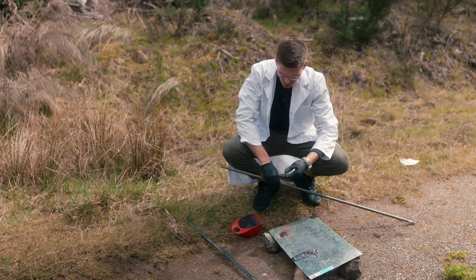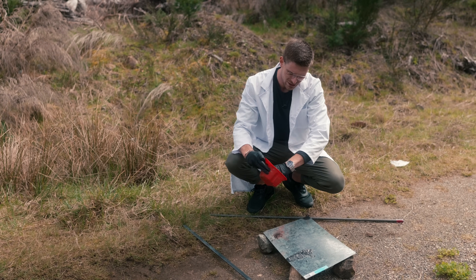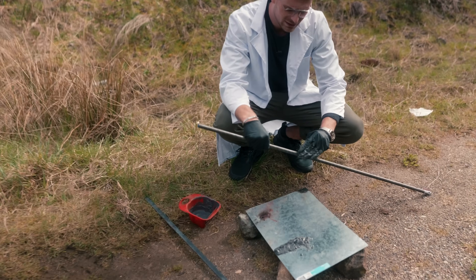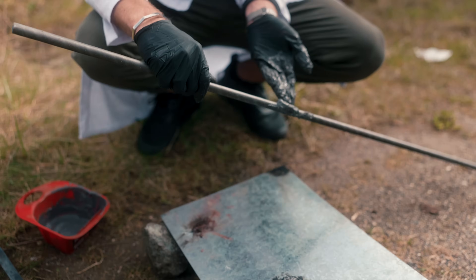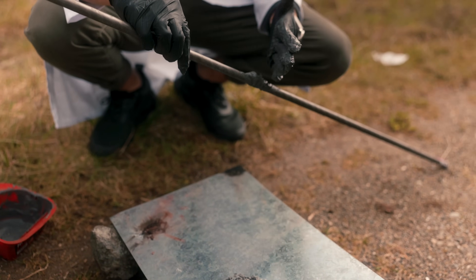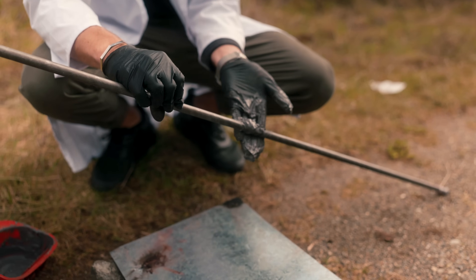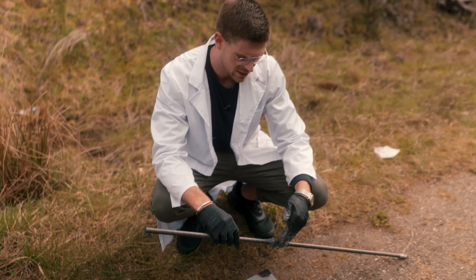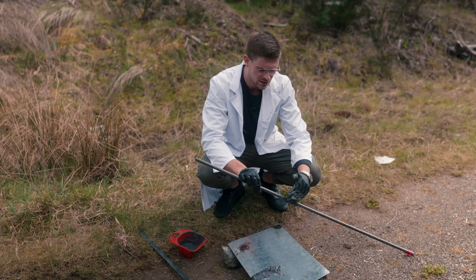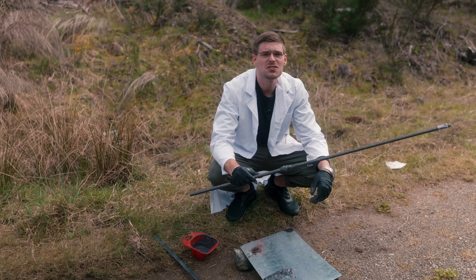We also have thicker options — more similar to a bar you'd actually have to cut through. Just in case the thin sheet works, I'm putting thermite goop on this bar too. That consistency is about what I want thermite paste to be — thick enough to stick in place but thin enough to still be malleable. As I said, plaster may slow the burn rate, since we're worried about thermite burning too fast to transfer enough heat to actually cut through.